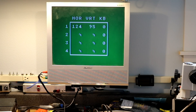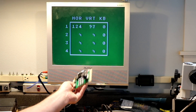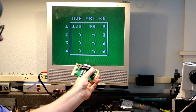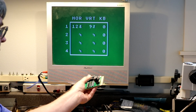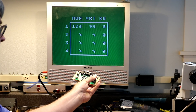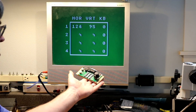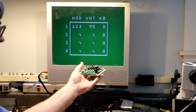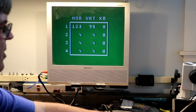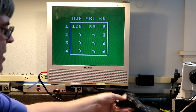This video is on another Atari 5200 controller project. If you watched my previous video, you might have seen that I built a homemade controller with a thumb stick, a couple fire buttons, a keypad, a digital potentiometer, and a microcontroller to translate between the thumb stick and the resistance range that the Atari 5200 was expecting. It's worked out pretty good, but I wanted to see if I could use a good old PlayStation 2 controller and what it would take to interface that to the Atari 5200.